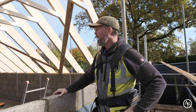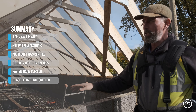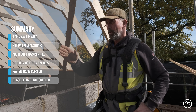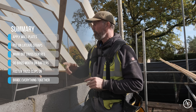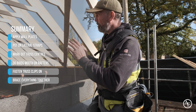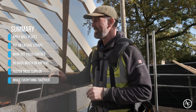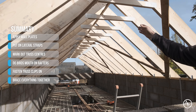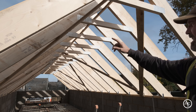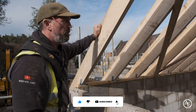There you go guys - that's how to put a truss roof on a garage. It's the same principle on a house. Let's break it down: first we put all the wall plates on that were supplied, then we put all the lateral straps on, then we marked out all the relevant truss centres at 600 centres. We then cut the bird's mouths on the rafters themselves and fitted them all along, nailed them all up, and got the truss clips on. The last thing was bracing it all up to give it rigidity - the ridge brace first to match all up at 600 centres, then all the cross bracing. You can see how solid that is - it's not going anywhere. And now we pack up and go home.